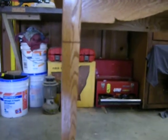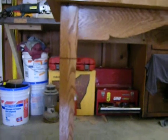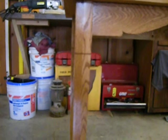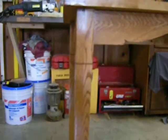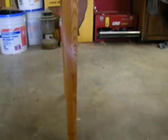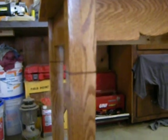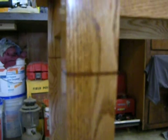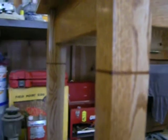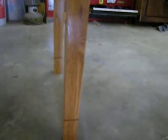If you look at the legs — Vanna Daniels here showing us the legs — you can see the legs are two pieces of skids glued together and then we tapered them on the table saw. Then we made a small slice in the leg and inlaid more of the mahogany that we got out of Ray Ramirez's basement, both on the top and the bottom of each leg.